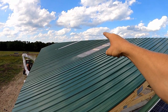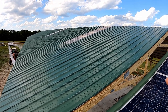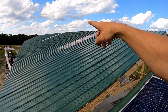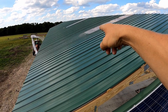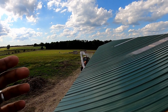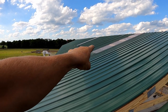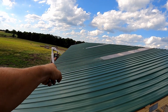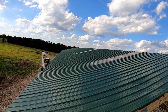And then you can see where we put the skylights in. Well, we just caught that we didn't get enough. They gave us all the clear sky panels, but what they didn't do was the piece underneath of it that we cut from the long panels. They didn't give us enough panels to do that, so they're going to send out the 14 foot panels we need. Well, we really only need 11'7". But they're going to send us some 14 footers, and we'll cut them to the length they need to be to fit right here, and then we'll put the skylights in.